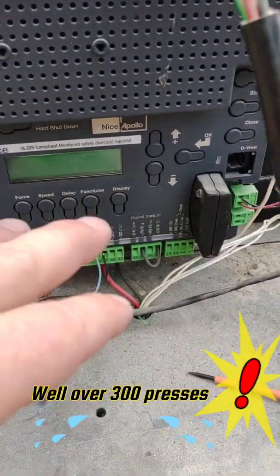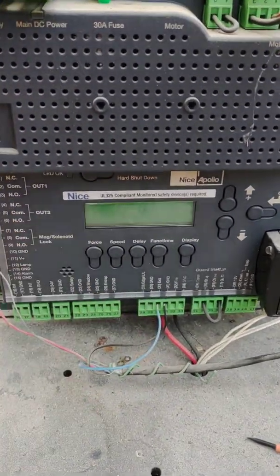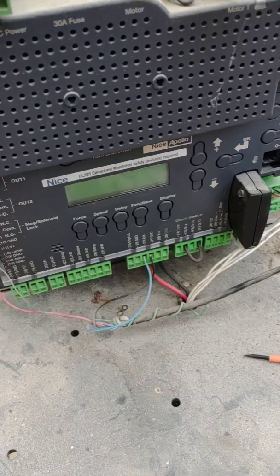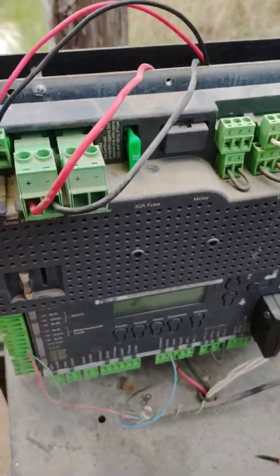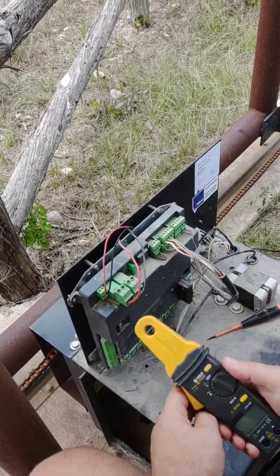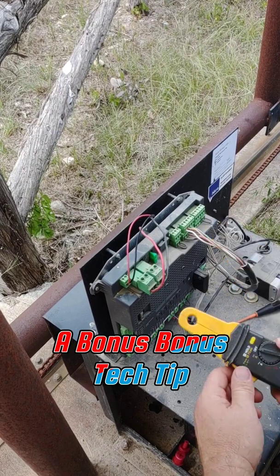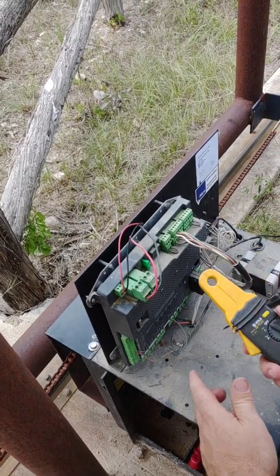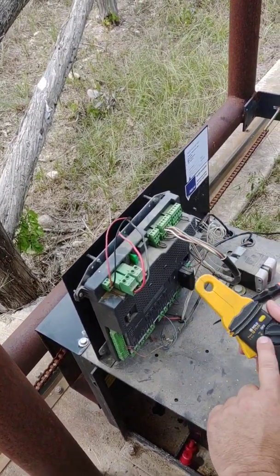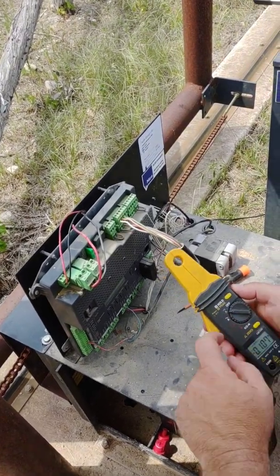The reason I wanted to go into display mode was to check the solar input to the board — it would have given me a voltage reading output. So I'm going to show you the old school way of checking to see if your solar panel is actually charging your battery. This is where your clamp amp meter comes in handy. Most techs don't have one of these. We're going to check for amperage — in this case, milliamps. Zero out the meter.